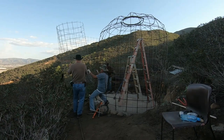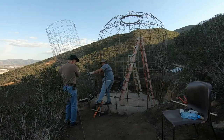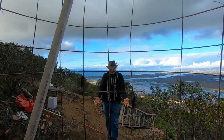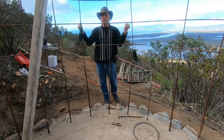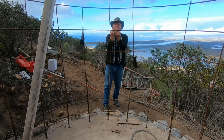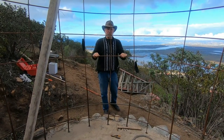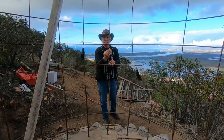We're leaving the wire in such ways that when we go to put the different layers of wire on, we'll be able to pull these wire ends and use them in our structure. We're putting our horizontals on the outside because they're like the staves and rings on a hot tub — they're holding everything in. If you were to put them on the inside of the verticals, it wouldn't do the same thing structurally, because then the verticals could be independent on the outside and move in an earthquake. This way everything's held to the inside.